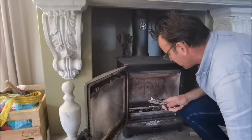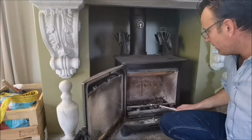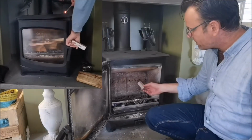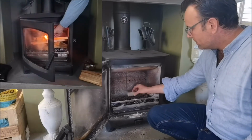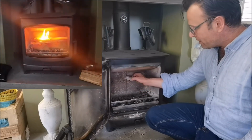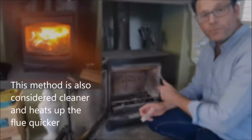as I was saying, a good tip is to allow the ash to build up, okay, so that you are not creating straight onto the bed of the pan. But when you light your fire, do a top-down fire so that you're not putting flammable items, strong flammable liquids and what have you straight onto your pan, so that you're actually burning from the top down. So there'll always be a little bit of a bed of ash, even when you've freshly emptied it.